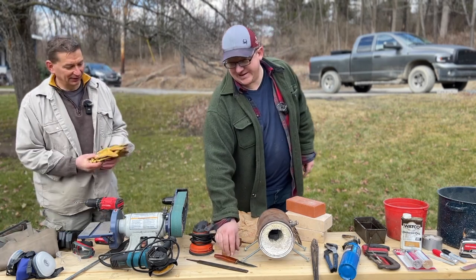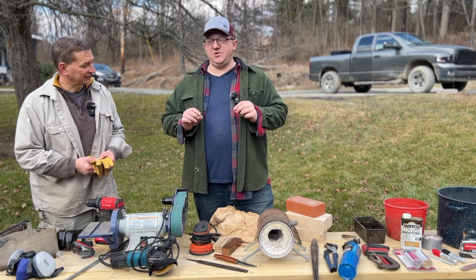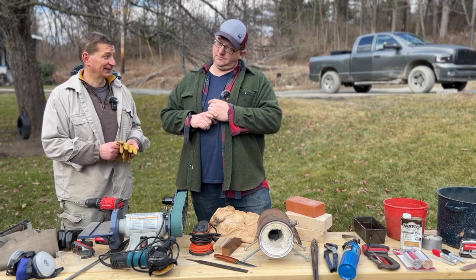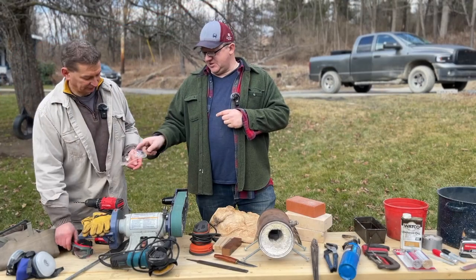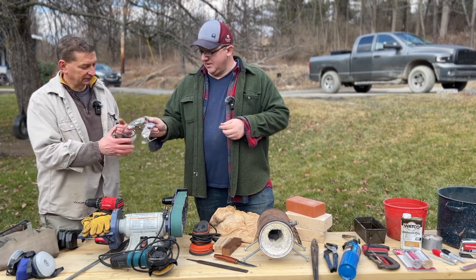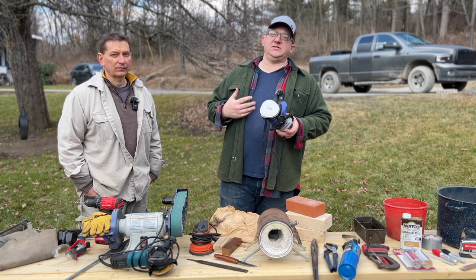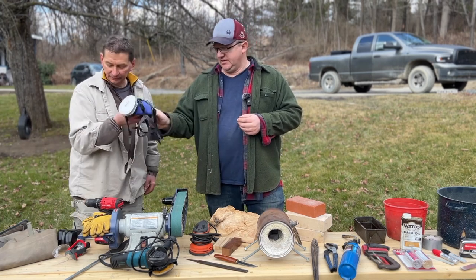Safety first. There will be some times when you're making a knife when you don't want to use gloves, but generally — especially when using high temperatures — use gloves. Even more important than gloves is eye protection. You can use cheap eye pro or fancy eye pro; either one will work. Use a respirator when you're sanding — you don't want wood particles in your lungs, and especially when grinding steel you do not want metal particles in your lungs. A respirator is a necessity.